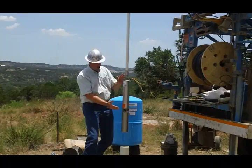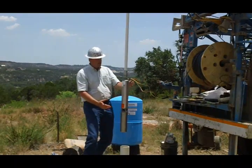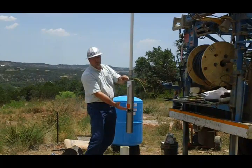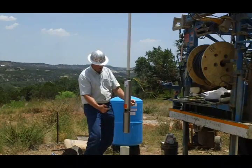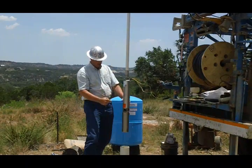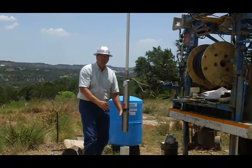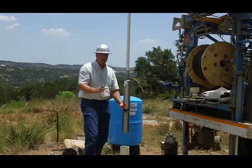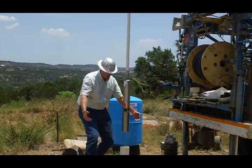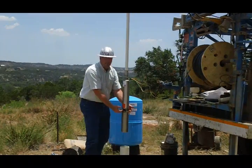So this is the two parts of a submersible pump. We have the motor down here at the bottom and it has this electrical wire that's running down through this wire guard to feed it, and then this is the liquid end — the submersible pump end itself. The water enters here between the two and it comes up through this drop pipe. We want the water flow to come by the motor as much as we can — it'll keep the motor cooler.